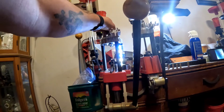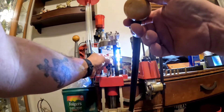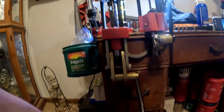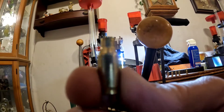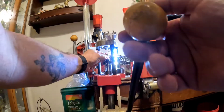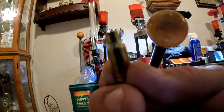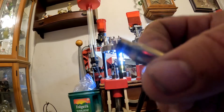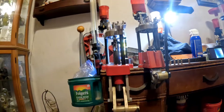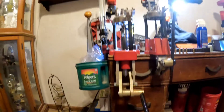These are now roughed out. We're going to bring it over to the finishing die — the .22 TCM Lee finishing die — and I like to run it through the die twice. One pass, and you can see there are no gouges, no rips. Running it through twice gives it more uniformity in the form. And that's what she looks like — perfect, no gouges, no rips. I've already used these reformed casings seven or eight times and still no cracks.